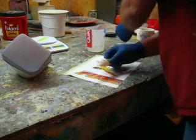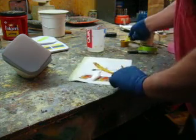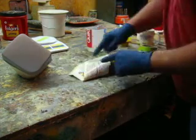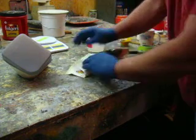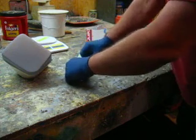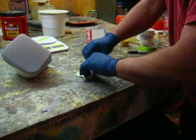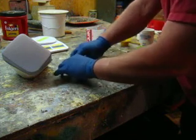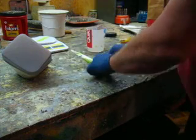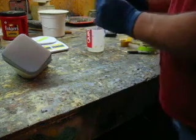I'm going to take some resin — I've got some micro balloons mixed with this. Just kind of put a little blob right there, fold that in half where the tape kind of sticks it right there, and kind of work that resin into the corner. Roll her up — there's a little pinch right there — and we're good to go.